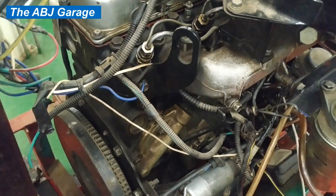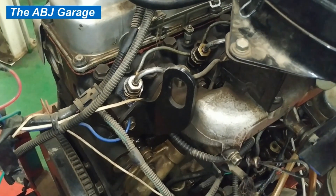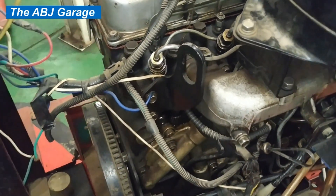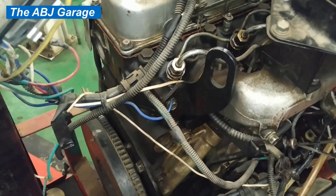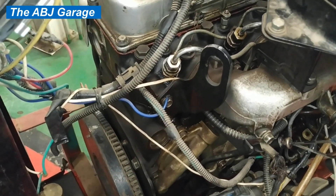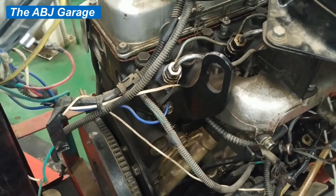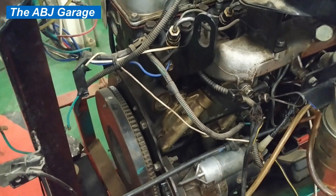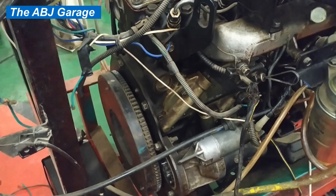For a gasoline engine, there are ignition lines coming to each cylinder — you disable the ignition system turn by turn. The test is similarly the same. In order to exactly quantify the amount of RPM drop, we can use a digital tachometer on a diesel engine.